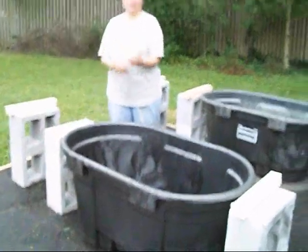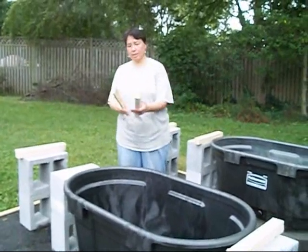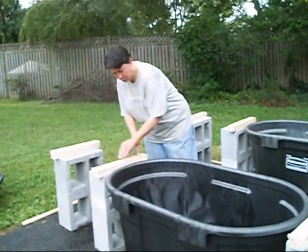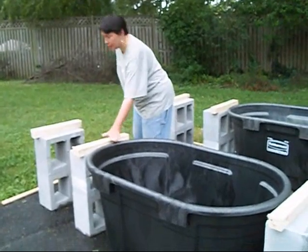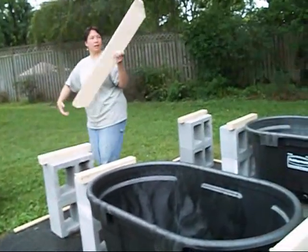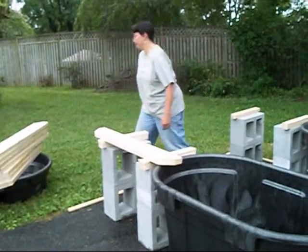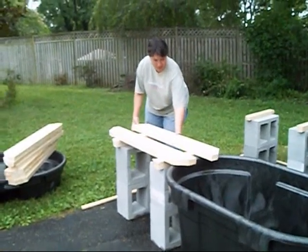What we've done now is cut a piece of 2x3 and a piece of 1x3, one for each of these columns. These are approximately 18 to 20 inches long, and what that's going to do is raise it just enough so that you can hang over this lip. The other thing I did is these 2x6s — each one is 44 inches long and I've cut the angles off the edges.